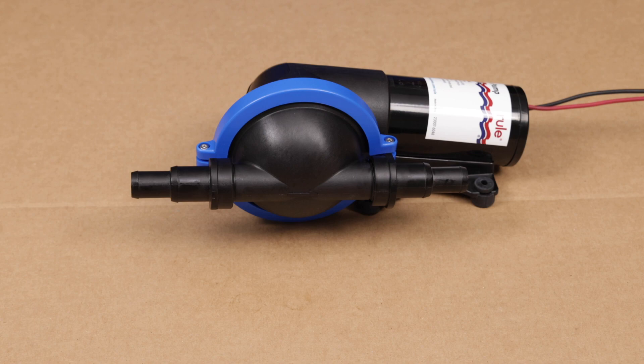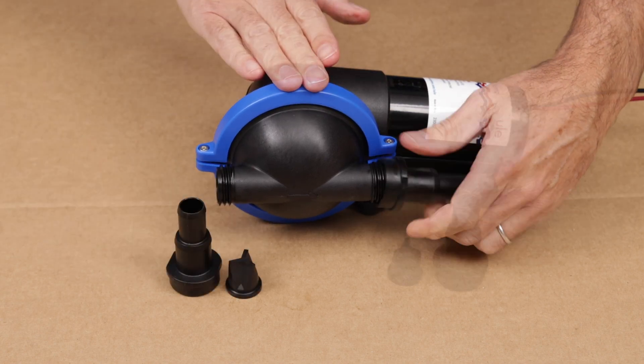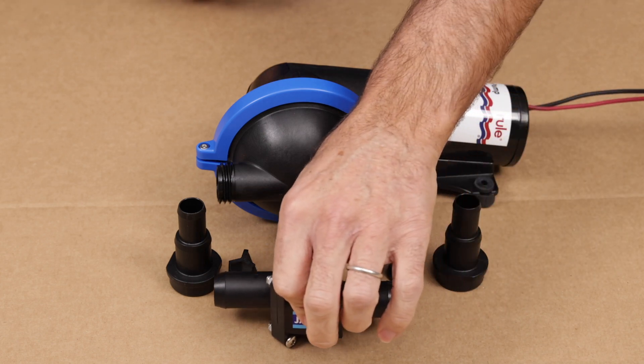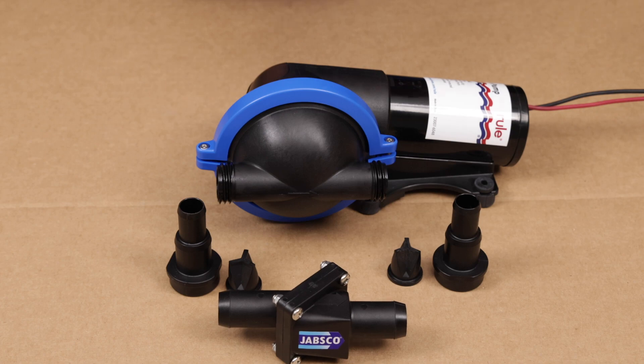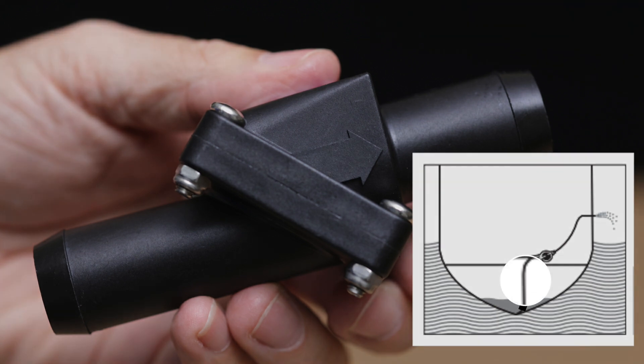Because the material pumped by a dry bilge can be a bit dirty, we've put check valves into both the intake and the discharge ports. Additionally, for the very bottom of the suction hose, we recommend installing our non-return valve, so that residual water left in the hose after the pump is shut off doesn't flow back into the bilge, but instead remains in the hose until the pump is started up again.